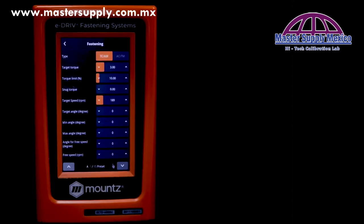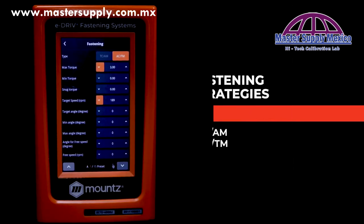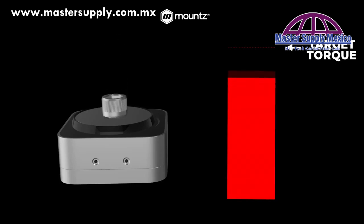Now there are two strategies that we can use when we are implementing a preset. The first strategy is TCAM. The second is ACTM. TCAM stands for torque control with angle monitoring. So we can enter in a torque value and the system will run to that particular torque value. With the AM or angle monitoring, we can also monitor the amount of turn in the fastener.